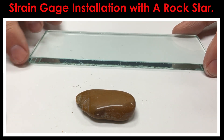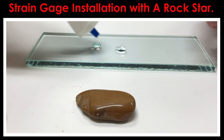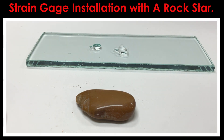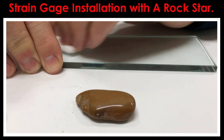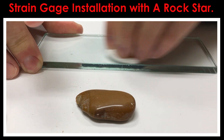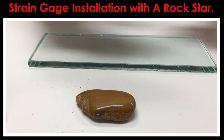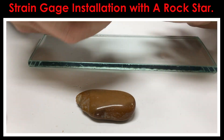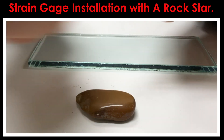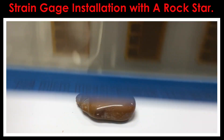What I'm going to do next is find my work surface, which is a piece of glass. I'll take a little bit more of the blue tip bottle, squeeze a few drops out, and take another gauze pad to clean off the piece of glass because my strain gauge is going to come in contact with that. I'll also locate my pair of blunt nose tweezers and clean the tips of them as well.